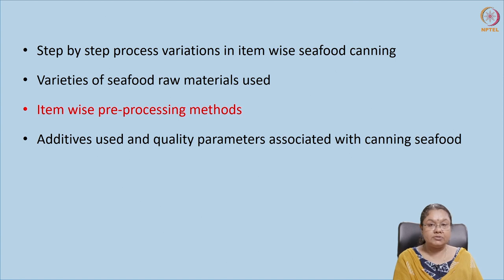We have also seen pre-processing steps, including what a grader is, the different types of graders, how grading can be done manually, and the different mechanized types of graders. We also covered sorters and washers. The washer is mainly used for removing blood stains and adhering materials on the surface of the meat or skin that give a bad appearance or interfere with tissue appearance. Slime is also washed out. The efficiency of the washer depends on the kinetic energy or force with which water is pumped into the machine.